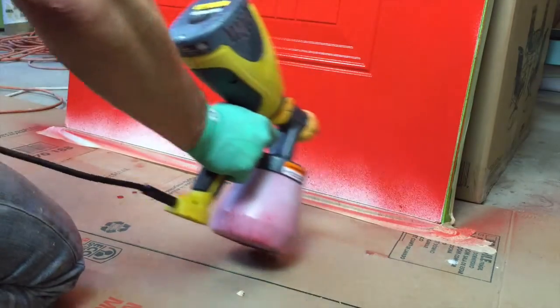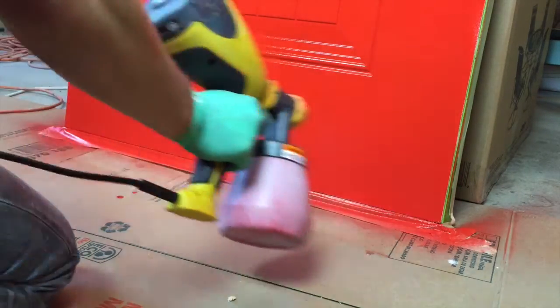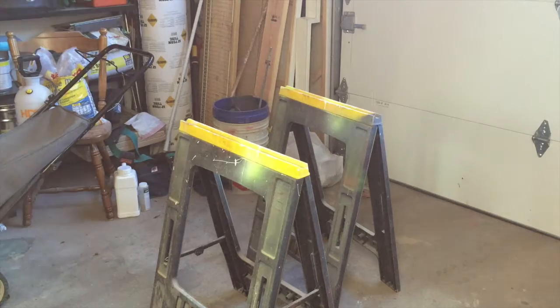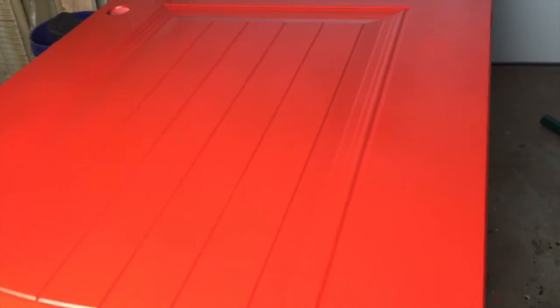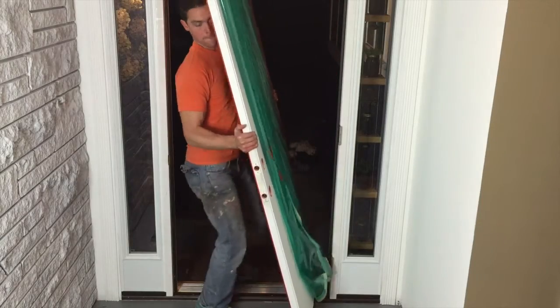With this additive it's very nice — it removes brush or roller marks and just levels out evenly. If you're using a sprayer, make sure you do a quick once-over the entire thing and check that you are not missing any spots. Once done, go ahead and set it down, let it dry, and definitely try to get a second pair of hands because it makes it a lot easier. Let it dry overnight, or wait a few hours and make sure it's dry to the touch before moving it.